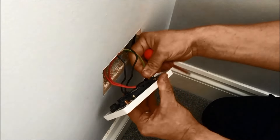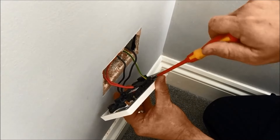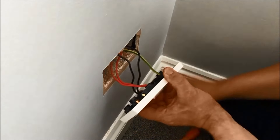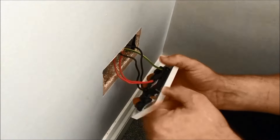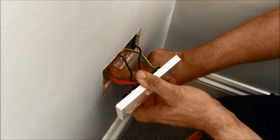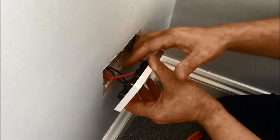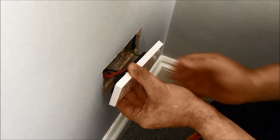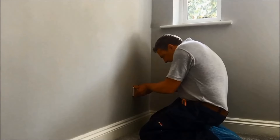And then finally the earth — let's get that one in there. Make sure they're fully in, both of them, and we'll do that one nice and tight too. I just want to check and make sure they're properly in there individually, and they're not going to come out when I push the socket back. Now I'm just going to shape those cables back in as I push the socket back in, to make sure they go in there nicely. I don't want any of them to go behind the screw terminals, otherwise my screw might nick the cable when I put it back in.